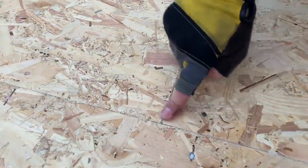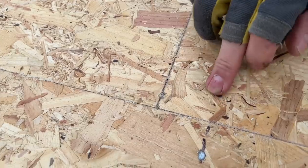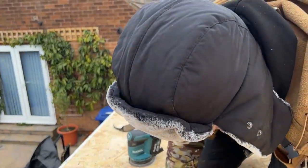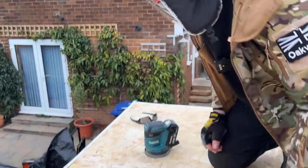Can you see there's like a ridge there? So I'm going to try and get rid of all that as well, and any nails that I haven't quite sent home — I'll stick the impact driver or the hammer on them and send them down as well, to make sure nothing's sticking up, nothing's going to protrude, nothing's going to impact on your rubber. Get it all nice and smooth and sanded off.